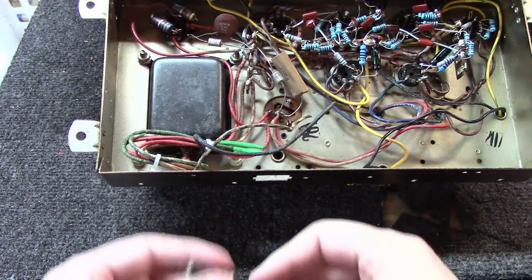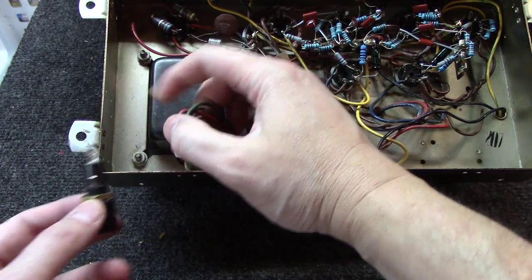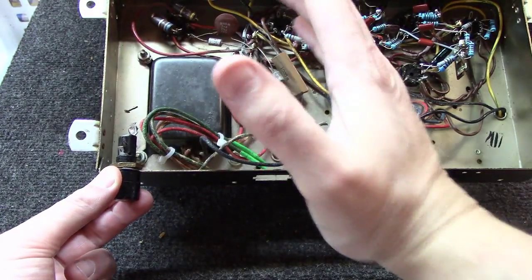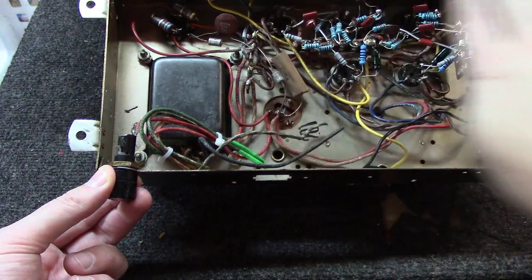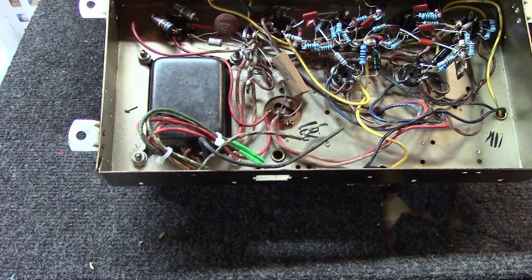And then the fuse, well, I'd like to put the fuse right here, but that won't work because I'm going to be butting up into that transformer. But I notice over here there's some dead space in between right here and here. It's a perfect place for the fuse, and it keeps all your power supply feed lines on this side of the amplifier and away from your more sensitive end down here on this side. So that's the route we're going to go.